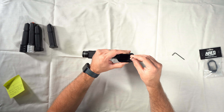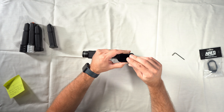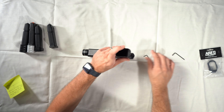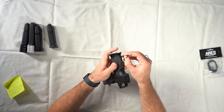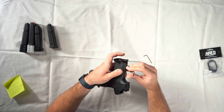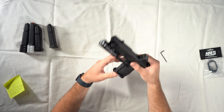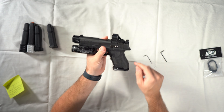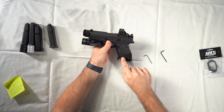Install your last bolt with the smallest allen key — just get it started, you don't need to tighten it all the way down. Go until it gets a little bit snug. Then go back to the larger allen key on the back bolt and snug that as well. Both should be lightly snug, not tight. Now look from the side to check the gap and make sure it is even.